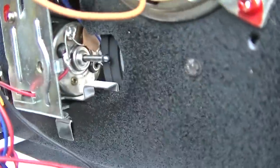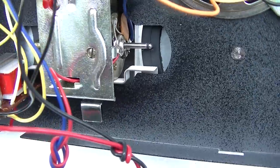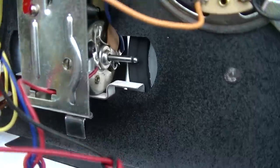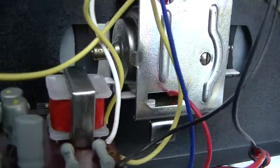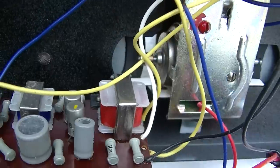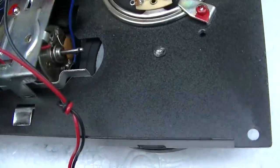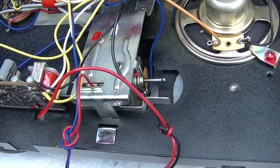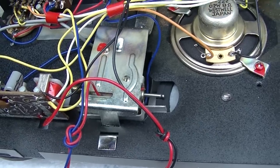Look at the motor drive setup. So that would be play, I guess. It does not use a capstan motor at all. That would be play. It would just drive that rubber edge on the roller, and then for rewind, it would drive that edge. So I guess what it does is it rocks the motor. Wow, look at that. Talk about precision stability for low wow and flutter.